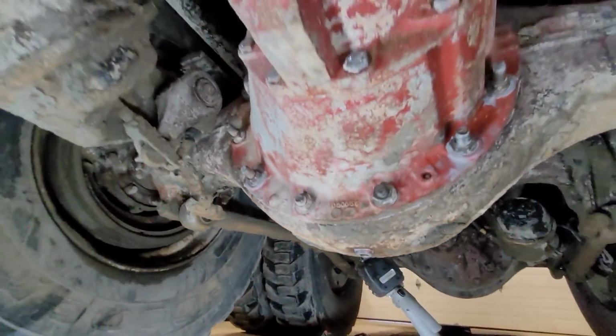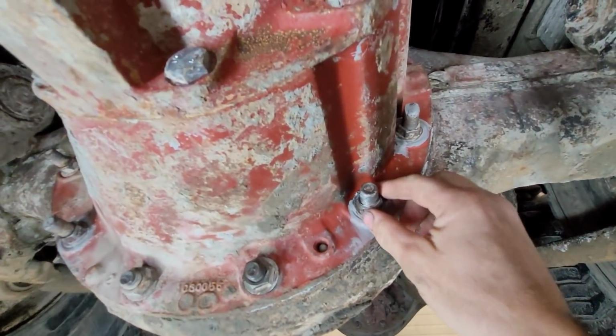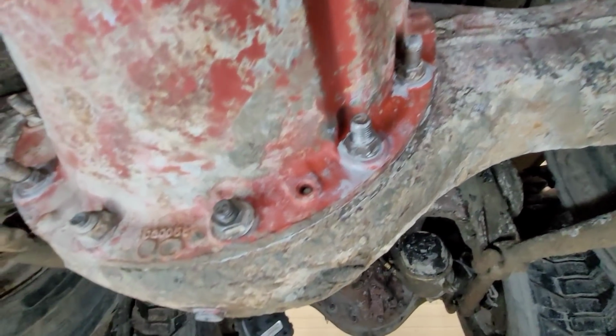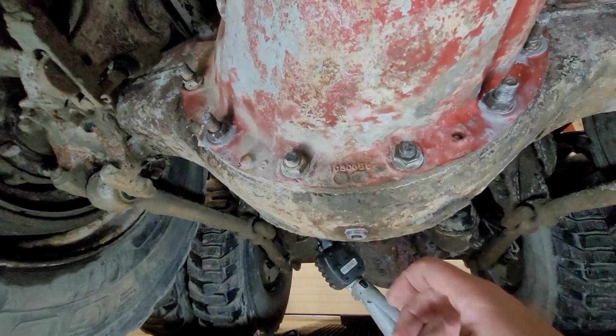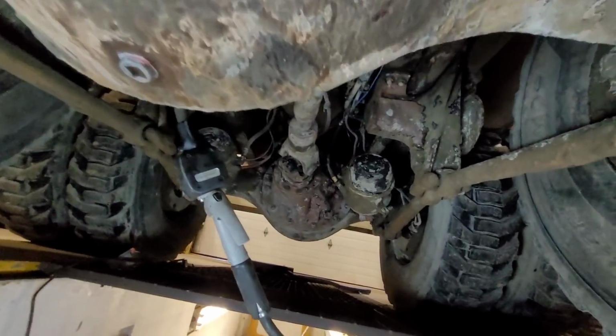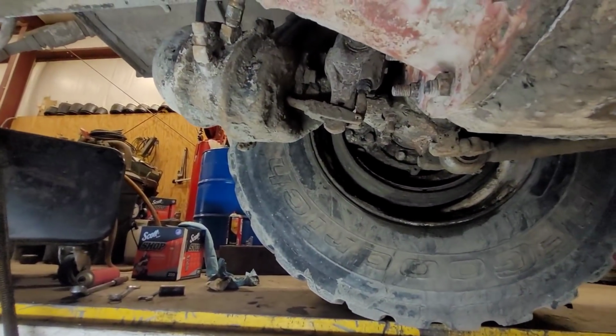that rear's back in there, and then this one we had torn up earlier in the year, and I guess when we put it together, didn't get some of the bolts tighter, didn't get some silicone around them, so they were leaking a little bit. So I was gonna pull it loose and reseal it, but when I found the nuts were loose, I just figured I would try to reseal the bolts.